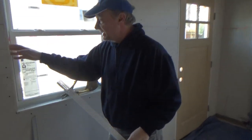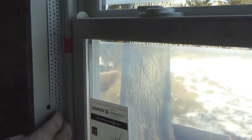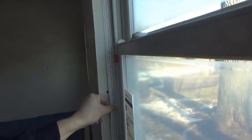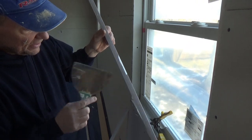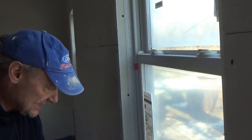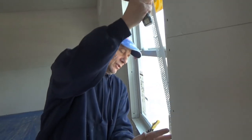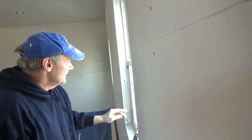Come take a close look at this. If I tried to put this piece in like this, see how it bows out right here? It won't lay flat. We looked really closely and there's a little chunk of wood trim that they trimmed this window out with that's sticking out. They cut it where the drywall is, but it's not cut flush with the window. So I had to find where it was and cut a little piece of that off. Now when I put this piece in — nice and flat, it just lays nice and flat. You have to be careful, you really want the stuff to lay in flat.